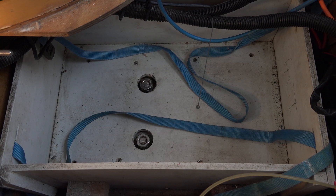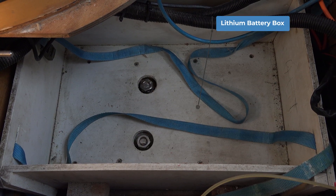The battery temperature is down to one degree despite the ambient temperature being seven degrees, so we now need to solve the problem of how to heat the batteries up on a boat in Cumbria. Below five degrees C we can't charge lithium batteries — the battery management system will switch it off. We need to use any available energy to warm the batteries up before we start charging them.